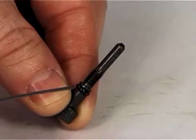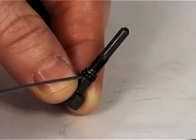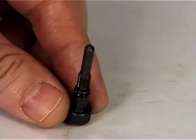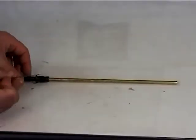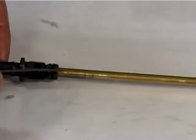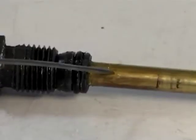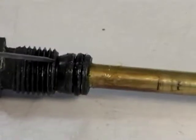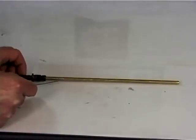Check for the good condition of both the knob, figure 14, and the corresponding seal, figure 42. Check for the good condition of the O-ring, figure 47. Check that the air conveyor, figure 50, does not present any bending and is properly fixed on the connector, figure 9, by means of Loctite number 542.